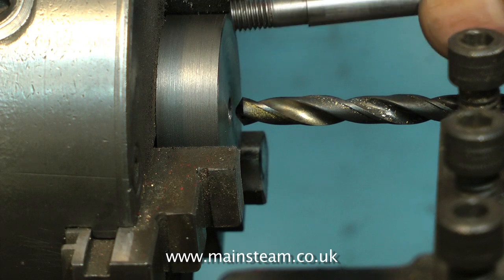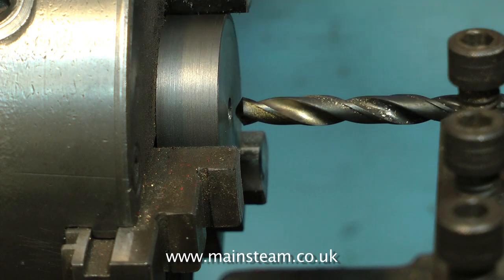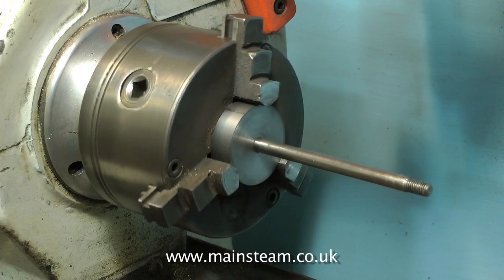As I said earlier, what I did was cut the thread all the way down on this piston rod, but it's a good idea to open up the hole slightly, so that the piston rod sinks into the piston and gives a much better appearance. You can see it here where the rod meets the piston — there's no raggy bit of thread there.